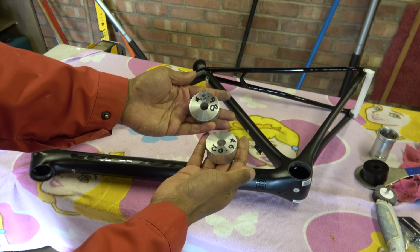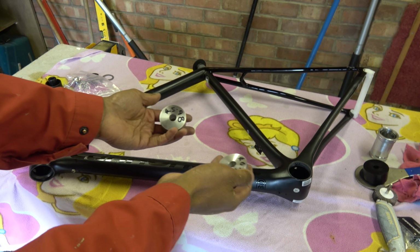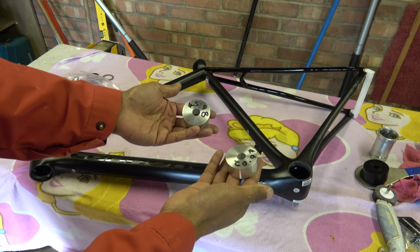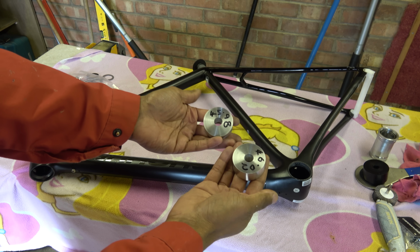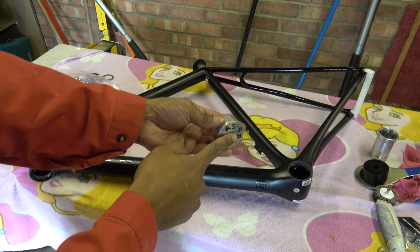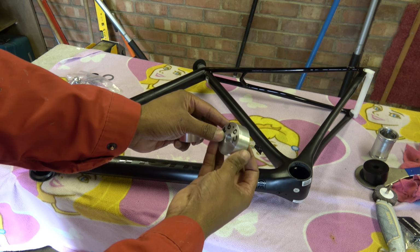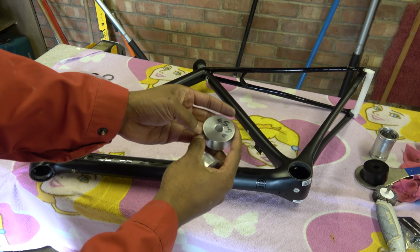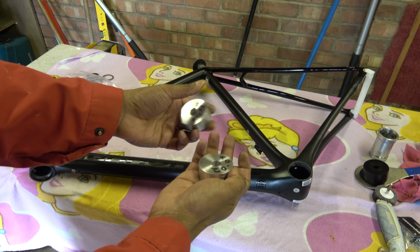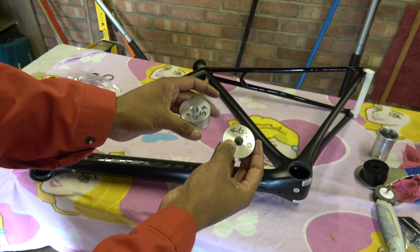so what I have here are little gauges to help me measure. Normally I would just use a laser to check it, but to be able to show you guys how this sort of setup works, I'm going to show you with these discs. These discs are just different sizes. The diameter of this side is 45.98, halfway across it becomes 45.96. That one is 46.02, and that is 46. So in an ideal world, you want the 45.96 to go in and the 46 to not go in. So there's your go and no go.